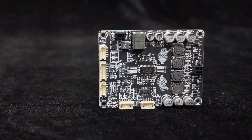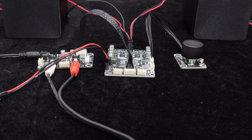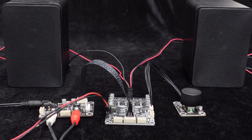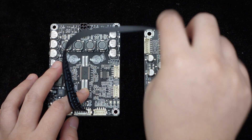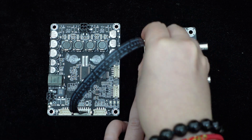Now, let's listen to its sound quality. For this demonstration, we are using our stereo 30W Dipo 1, a CS5343 signal conversion board, and a pair of 2.5-inch full-range speakers. The CS5343 analog to I2S conversion board converts analog signals into I2S signals.